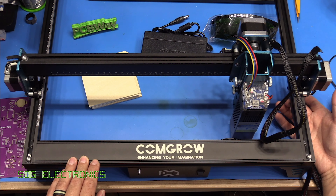On the website they've got some other accessories you might want to buy. I do recommend some form of ventilation, purifier, or filter because this can generate quite a lot of smoke, particulates, and other nasties when you're burning through certain materials. The unit has quite a large work area of 400 by 400 millimetres and the machine itself is almost 600 by 600 millimetres, so you need a reasonably large desk. The laser has a spot size of about 0.08 millimetres for both the 5 watt and 10 watt versions, and the PWM value can be adjusted from 0 to 1000, allowing reasonable grayscale printing.